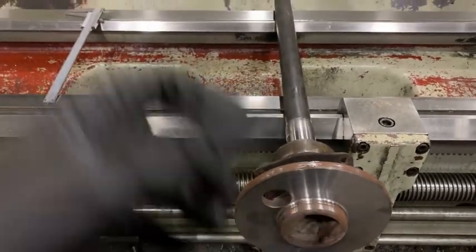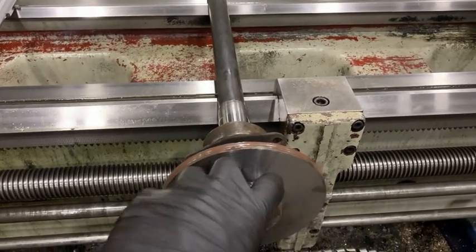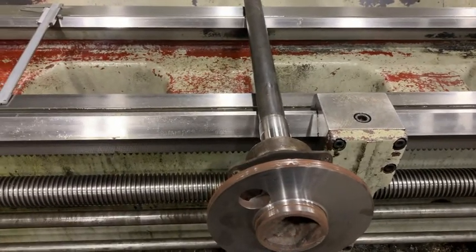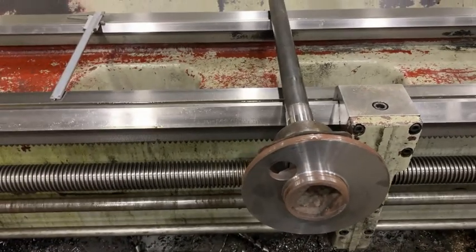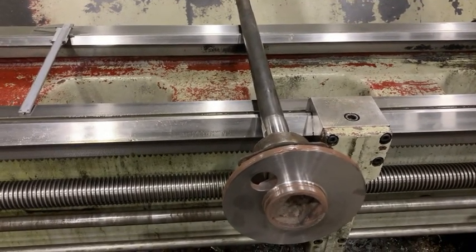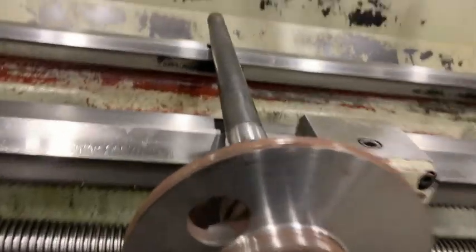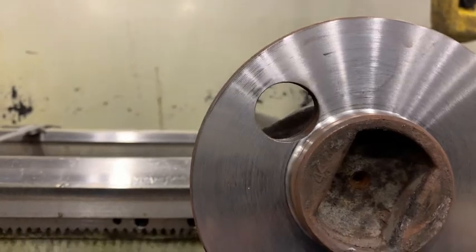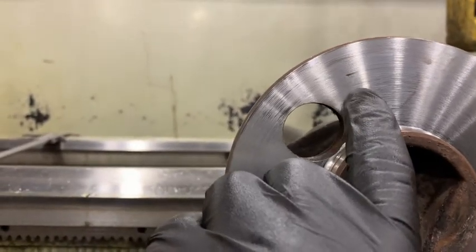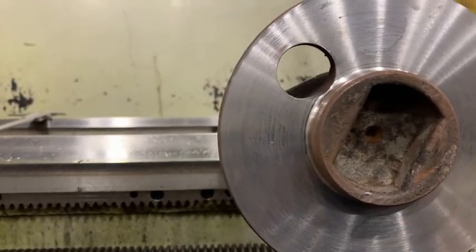So the next plan is I'm going to take it home and do it on a Bridgeport-style mill, running a chuck over on a set of boring bars. Years ago we had drill fixtures made up that would spigot on here with different bushings you'd pop in and out, but one of our managers threw all that junk out. We used to shorten a fair amount of rear ends here too — old Ford 8s and 9s especially. Anyway, this is a favor for Dan, so hopefully this weekend we'll get it set up. He's only putting 7/16 studs in, and I think he wants a 4-and-3/4-inch pattern. The issue is where the old holes were — you can get four of the new ones in, but the fifth falls in the middle and you just don't physically have enough room. I've got to double-check, but we're doing 5-on-4¾, which puts them a little farther out than original, but that'll be fine.